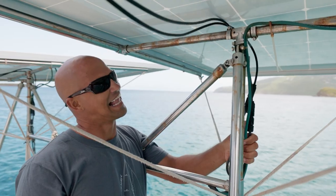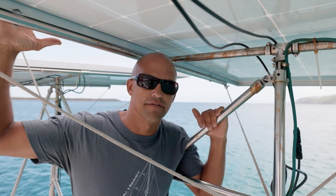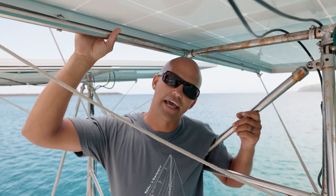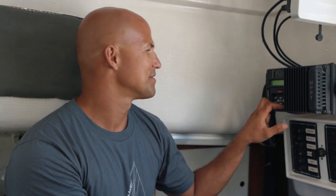Those zip ties did not last — I really should have put conduit there. Oh well, live and learn. The panels are wired in series, not parallel, because we run a 48-volt battery bank. A single panel alone wouldn't provide enough voltage to charge the bank, so I'd need a secondary step-up converter. Instead, I got two panels and wired them in series. On average we bring in about three and a half to four kilowatt hours, which is decent for us — we've only got 700 watts out there, but tilting them definitely helps.